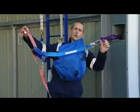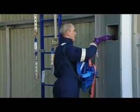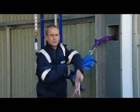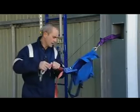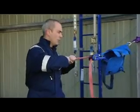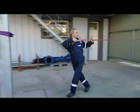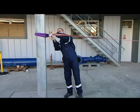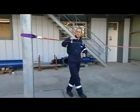The webbing at the end of the kit is stitched into the bag with a loop and another connector, and that's going to go directly onto the sling. I've attached the bag end first because I can then use this point as an anchor point to span the rest of the horizontal safety line across. I'll start pulling it through now — see how it's just feeding through the ratchet — and clip it directly onto the sling, making sure it's quite high up in relation to your body.